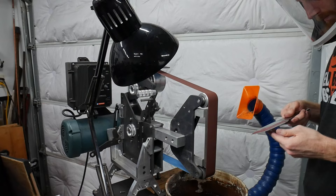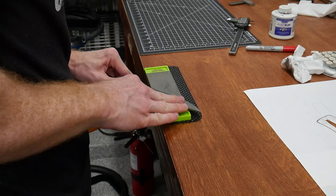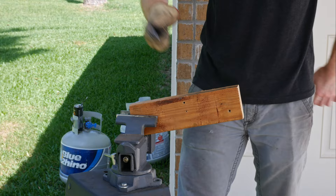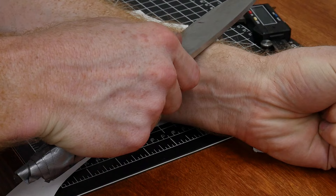Once I got the convexing in, I decided to take a page out of Kyle Royer's book and test the blade before going any further. I sharpened it up on my diamond stone to a good working hair-shaving edge and then went outside to cut a 2x4 in half. I wrapped the tang with duct tape to get a good grip while chopping the board. It took a little time but the knife performed pretty well and was able to still easily shave hair after testing.